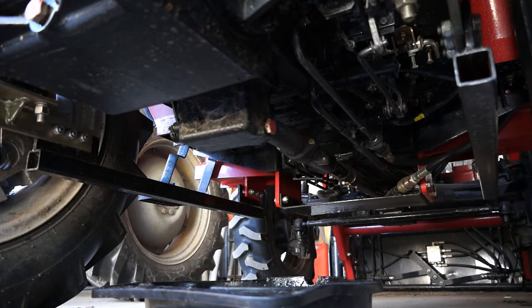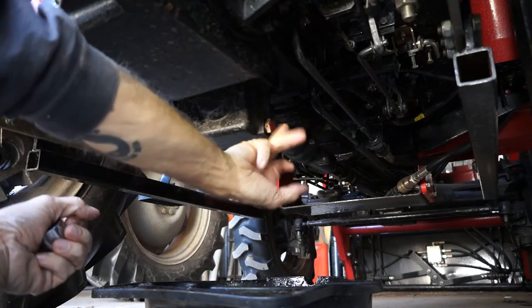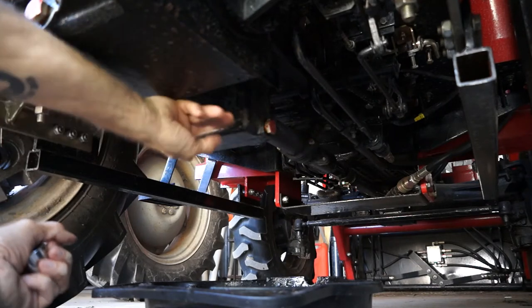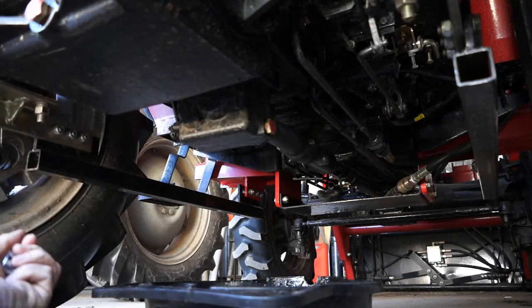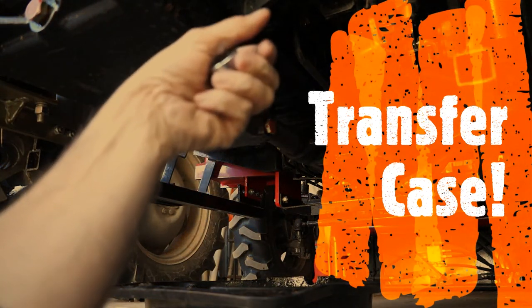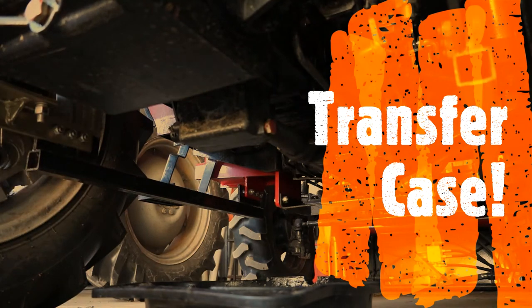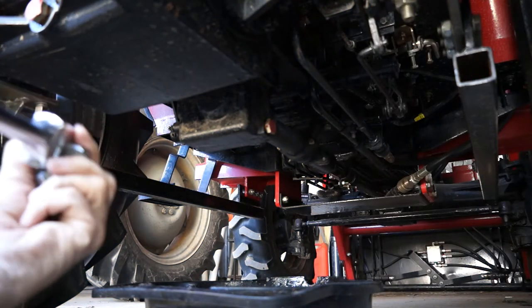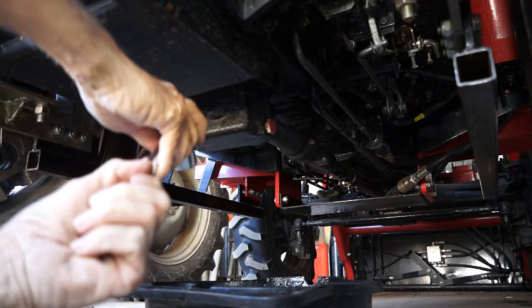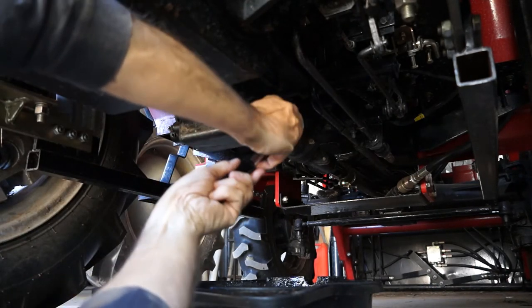So what I want to deal with now is this drain plug. Alright, it's a separate item here under the diff. Does it take the same oil? I don't know. I'll have a look in the book and try and explain it later. But if it's red, it's for us to maintain. 24 mil again, so it's the same as the drain plug we just used.